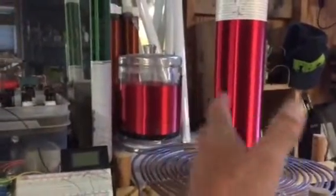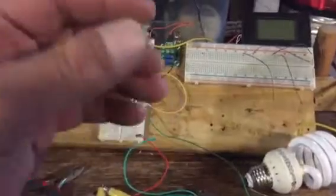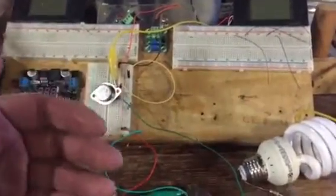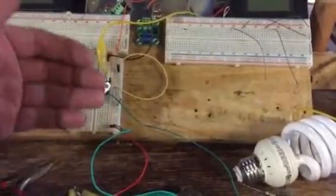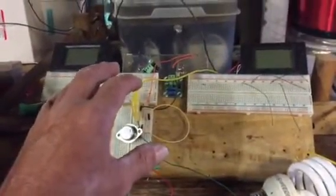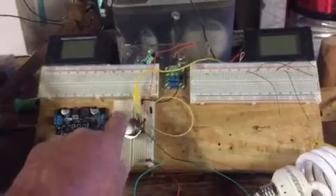if you're getting heat, you're getting a lot of volume going through there. Your frequency is based on the coil. The coil is driving the frequency that's going on in the transistor. The transistor will overheat if the current is strong through the transistor. So you have to defer the heat. Now, heat sinks is a way to defer it, but also you can go after the energy inside the transistor. You're not depleting from the load, which is the primary, which is running straight off the battery, but you're depleting from the bias between the base, which is the bottom of the secondary, and the negative side of this. The negative side of the battery goes through this in order to go through there, so the heat's being built up in this casing.